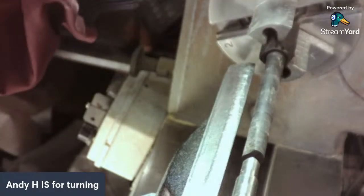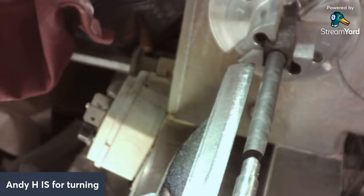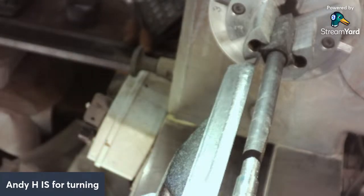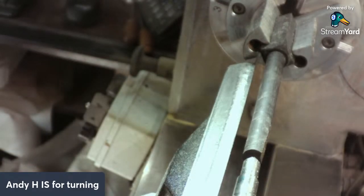We've got two chances. I've got the piece of wood on the lathe, which I shall bring up now, which is probably that one. There it is. If you can make that out, it's in a pen grip, pen chuck at the moment, because the first thing I've got to do is to turn it to 12 mil diameter, because then I put it into one of the collet chucks that Axminster sell, because that way you can have just a small amount. Let me find it. Here it is.